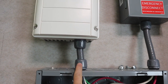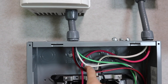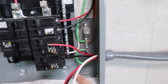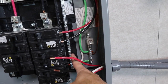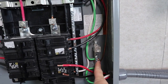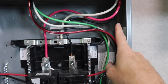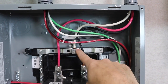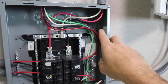It's the same on the auto transformer by SolarEdge — line one is red, line two is black, neutral is neutral. For our neutral from the new Growatt transformer, we're going to connect into our neutral bus bar. We've got our grounds on the grounded bus bar, and then everything is grounded back to our main panel. All the neutrals run back to our main panel, which is where our ground-neutral bond happens.